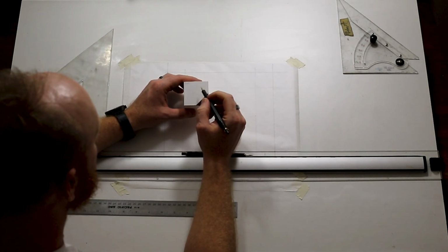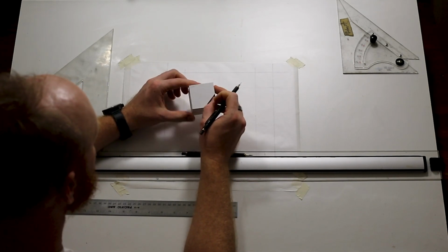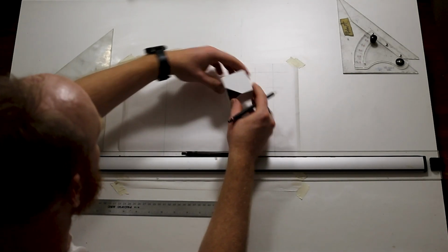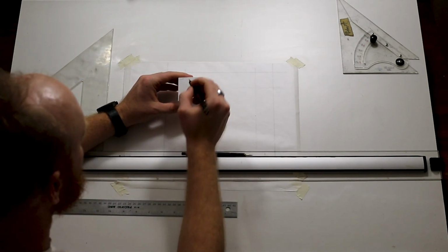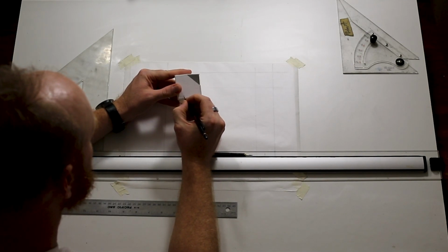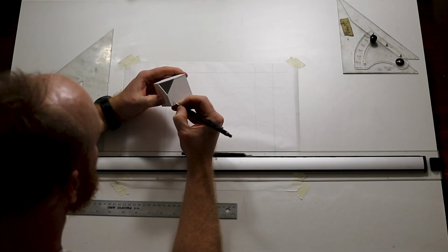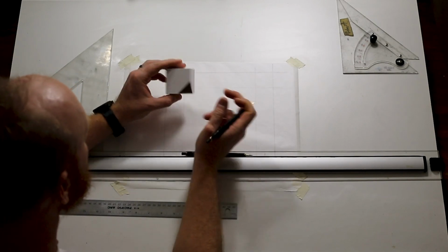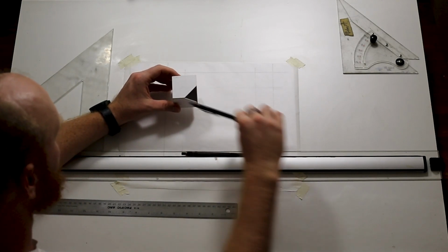If I do that, top, then I can decide on an orientation. I think it asks you to put it either this way or this way. I suggest like this because it'll work nicely on this piece of paper, but if you do it this way, you might place the drawing in a different place. So let's start with this, which means that this would be my front view. You're going to see a lot of the examples have this kind of setup. So top, front, right side, and then left, back, and bottom. But I'll start with those three. To begin with, those are our primary multi-view projections.